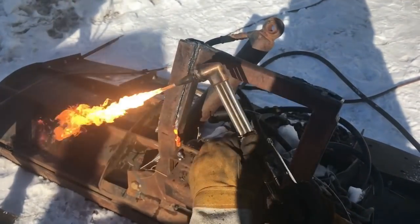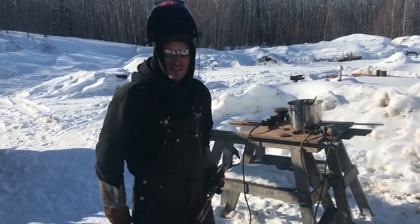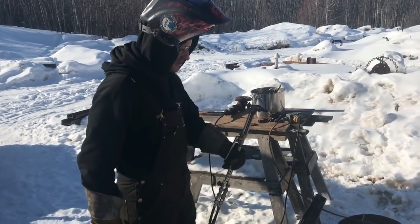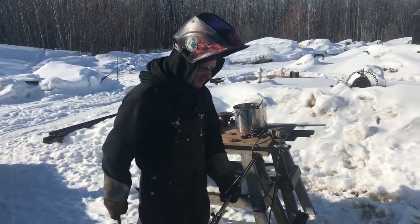Gouging stuff is a matter of setting it to oxidizing and just feathering the oxygen. So you're just melting, you're finding where that weld puddle is and you melt it away. It doesn't look pretty, but...